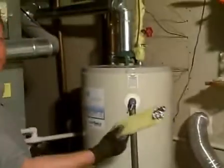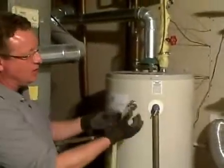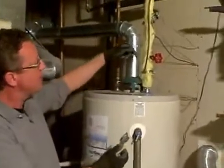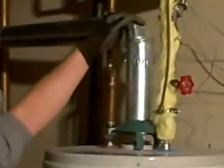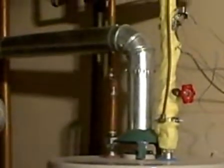If you're using fiberglass, it's much easier if you work in three- or four-foot sections. I would either use a little piece of wire, or in this case I like the aluminum tape — just start it and wrap it around the pipe. You want to overlap it about a half an inch, and you don't want to pull it too tight. You want it snug, but you don't want to over-compress the fiberglass.